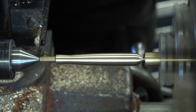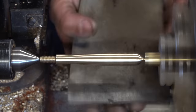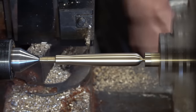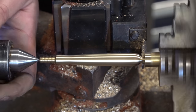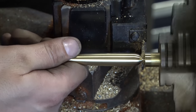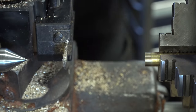I'm using a pretty fine file so I'm not picking up too much, then I sand up to 400, 600 grit. Then this is a buffing 3000 grit foam sanding pad that I love — it polishes it up just enough so it's not a mirror finish, but enough to kind of hide the fingerprints and still make it look nice and shiny. Which is obviously what all brass needs to be.